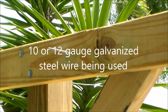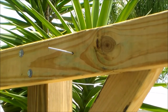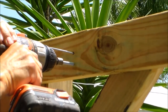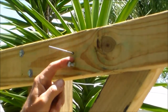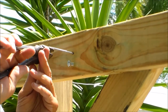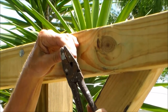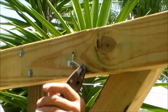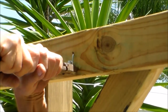When I get the wire pulled all the way through, I take a lag screw — this is a 2-inch lag screw — and I'll put it below the hole, leaving about a half inch stick out. Then I take my pliers, grab about a half inch of the wire, and I start wrapping it around. Make about two or three wraps.